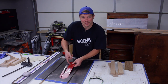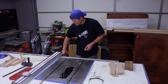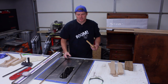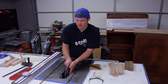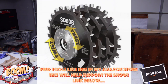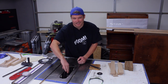Unlike last time — you can check that video out over there — I cut all the joinery using a single blade, which is a full kerf or eighth-of-an-inch thick. This time I'm going to use my dado stack and try it a little differently to get these joints tighter, because the joints weren't exactly the best last time and I had to do a little filling. I'm switching to a Freud Diablo dado stack, the SD608 — not a wobble blade. I have it in my Amazon store if you want to pick one up. It's a really versatile dado stack. Let's set this up and I'll show you the first joint we're going to cut.